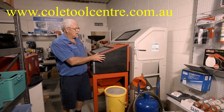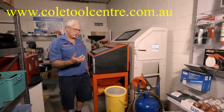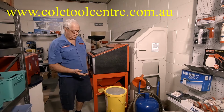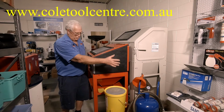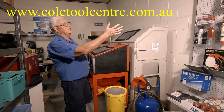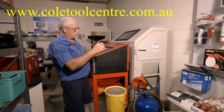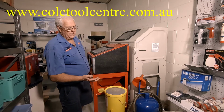So this type of machine here would run for a while, then you would have to wait for the air to replenish itself and start again, because what's happening is the pressure drops, then the volume drops, and it just wouldn't be working efficiently. So to run it continuously, you need at least 20 CFM, and that's for this or these here. The smaller units, because you're only doing intermittent work, it's not really a problem. But anything that's doing large areas, you just have to keep waiting for it to catch up with the air.